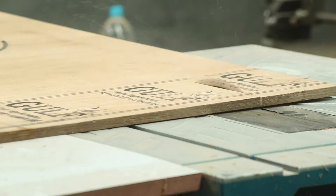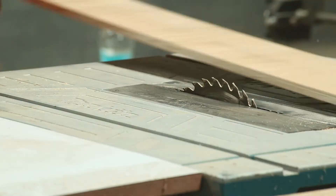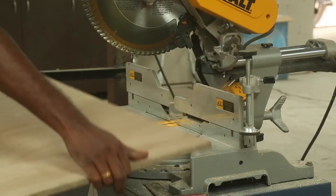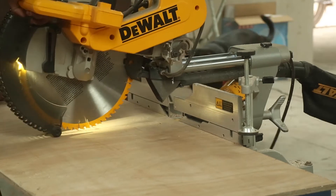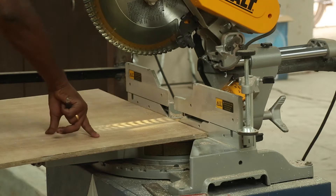To make the enclosure I am using 12mm plywood. To cross-cut it I use the miter saw. Its sliding arm can cut up to 16 inches, but for extra width I can flip the board and then cut the rest. This usually gives a clean cut.